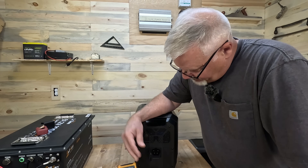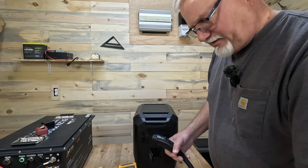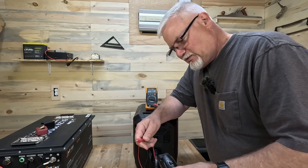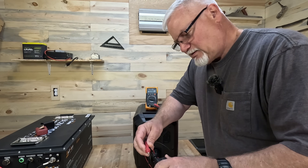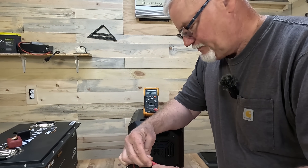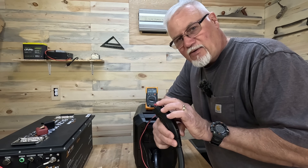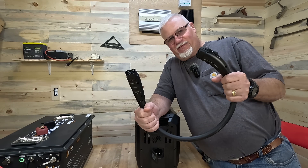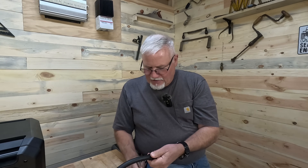I don't know why they would have two there, but they're all active. Now, if I take this and plug it in here — it's a big, heavy cable — I just want to make sure that this cable is, in fact, still live. I've got kind of bad leads; this is an old multimeter. If I plug it in right there — 53.6 volts. So that means that with the unit on, there's power to this end right here. Let's turn that off. The next step is going to be cutting the end off. Both ends appear to be identical, so I don't think it matters which end I cut off.